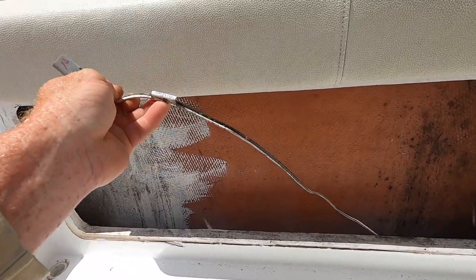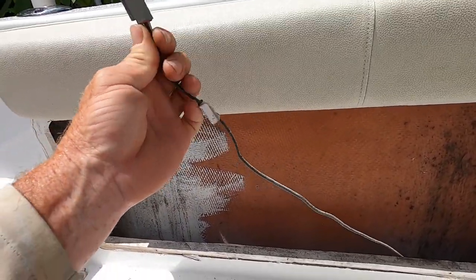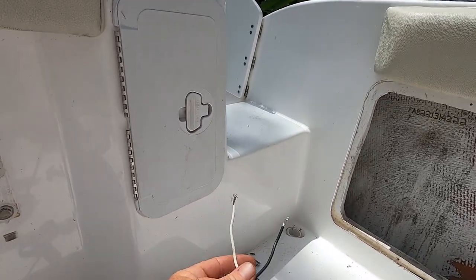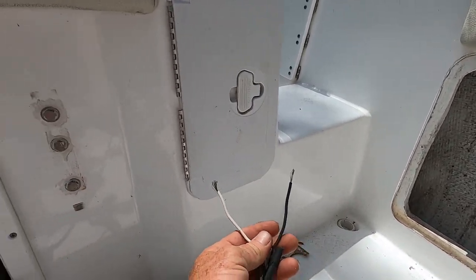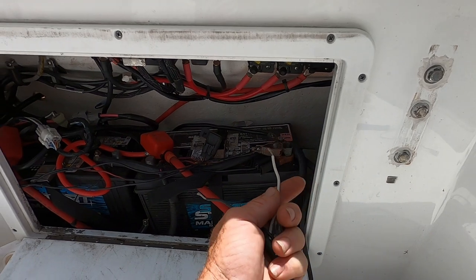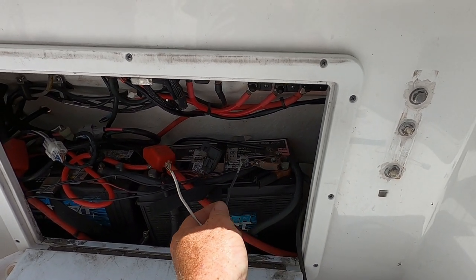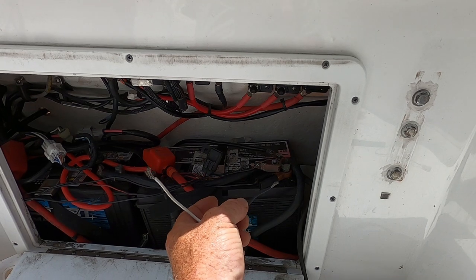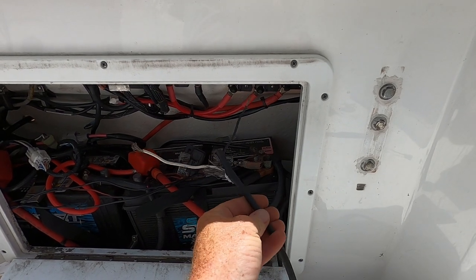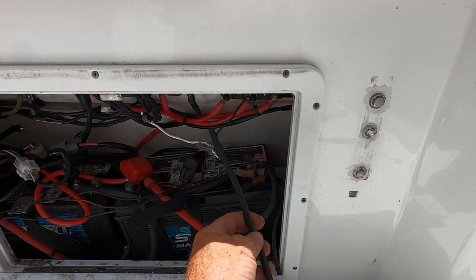I had to take apart my gunnel to get to this other side here. There's the black and white wire — I made sure it wasn't the connection. So I went ahead and cut it and hooked it directly to the battery. Hook it on one side or the other and it makes it go up or down. It sounded like I had water in it and it arced really bad either way, so it had to be the actuator. That's how I narrowed it down to it actually being the actuator.